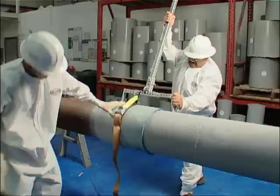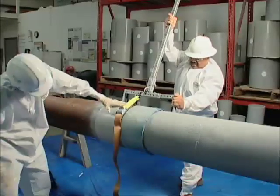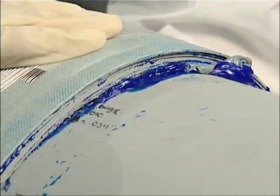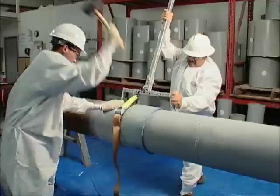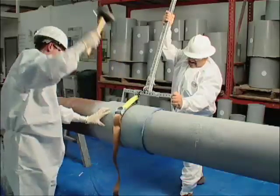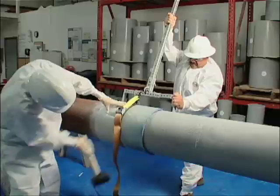While maintaining pressure with the torque bar, and after the excess adhesive and filler putty has been exuded, tightly apply two to three wraps of securing tape approximately one inch from the sleeve edges. Should the sleeve spin during the tightening process, remove it immediately from the pipe and discard.